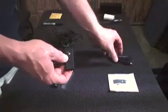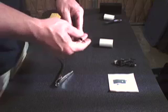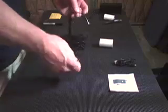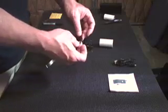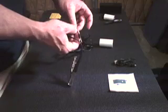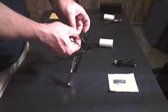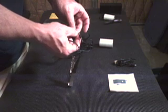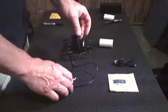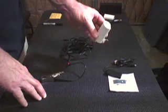The probably most difficult part of the whole job is to splice the mono cable from the microphone — carefully separate the two right and left channels, join the right and left positive and negative together, and then the shield for both goes around to the shield of the mono microphone.